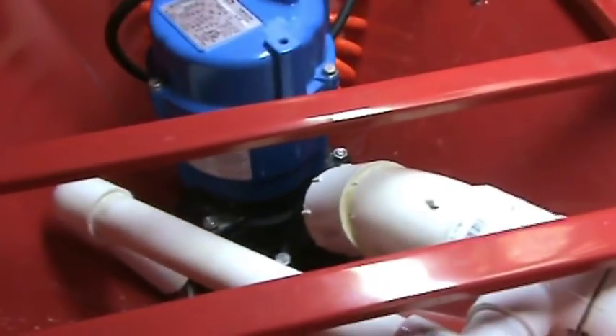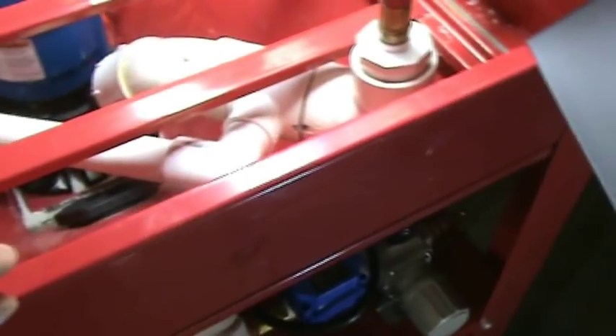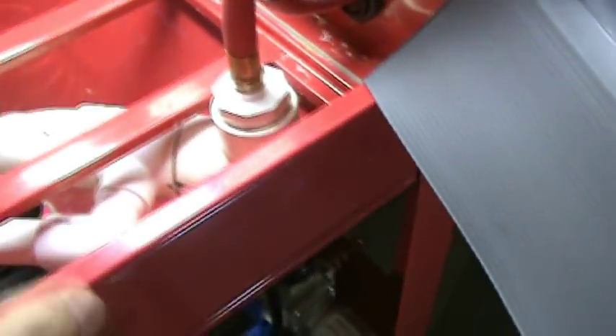I added a barrier on the bottom of the door — it's floor molding from a commercial building, which I bought at Lowe's for $1.85 and cut to length. When I close the door it goes along and from the inside makes a small little ramp that keeps the glass bead and water from collecting on the top edge. It's not that it drips out when I open the door, but there was a thick layer of glass bead and water getting knocked off when going in and out with parts. Now you can just rinse that area quickly when you're done.